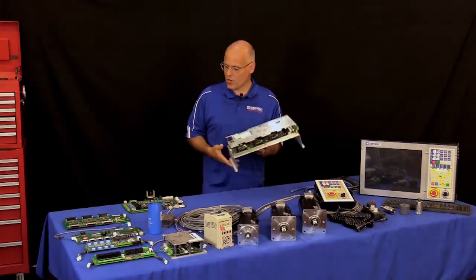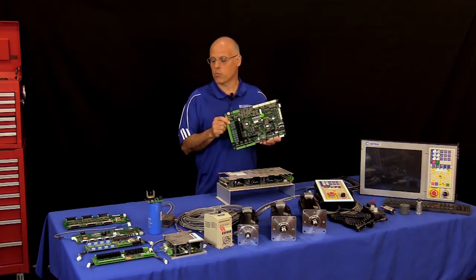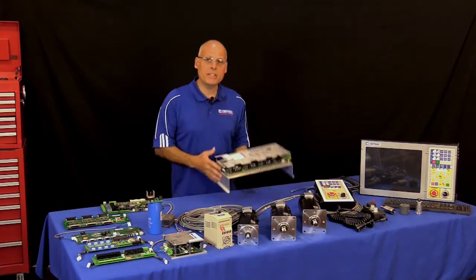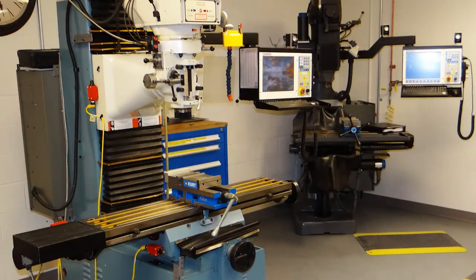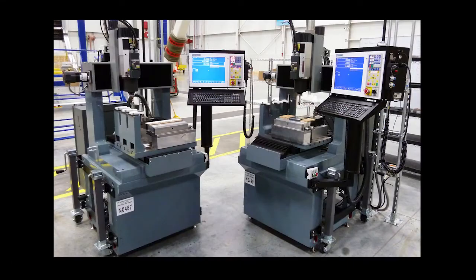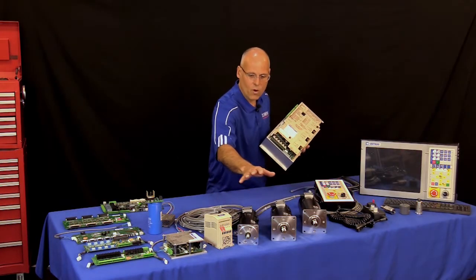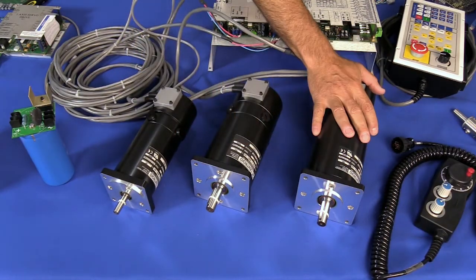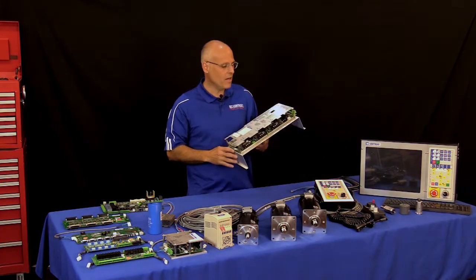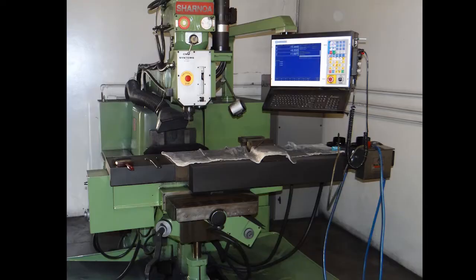The Oak Board is more for larger machines or machines that require an AC brushless servo drive system. The All-in-One DC certainly has a niche market covering bed mills, knee mills, flat bed lathes, small and medium slant bed lathes, small VMCs, medium-sized VMCs, specialty routers, water jets — all types of machines running a 17, 29, or 40 inch-pound DC servo motor. There's nothing better on the market right now to retrofit an existing CNC machine that has DC servo motors.